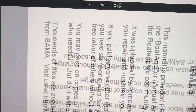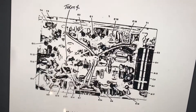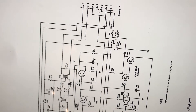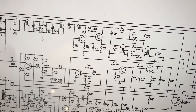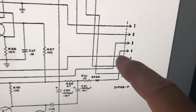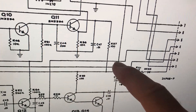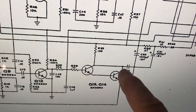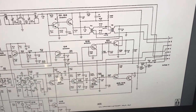Let's go back to the schematic. Click click click — okay. There's pin 4 again: one, two, three, four — right there. Goes back to here. So on my radio this gets grounded to turn off the noise blanker. When it grounds that point, I guess it doesn't then feed that wire. Well, let's hope it works — I followed the procedure, so we'll see.